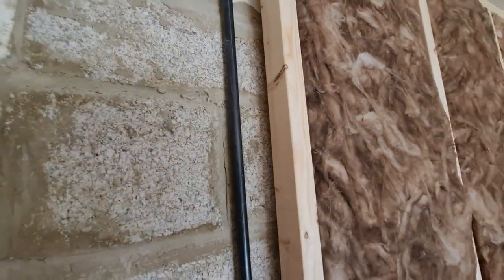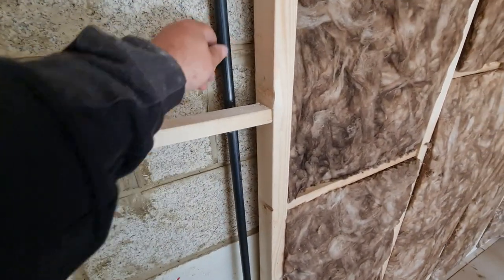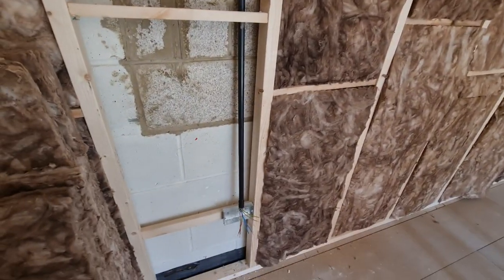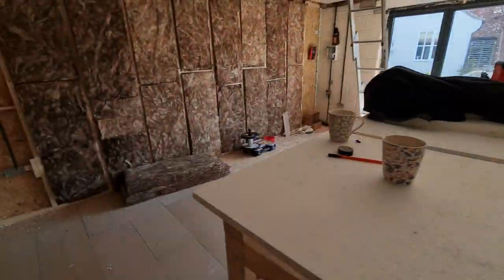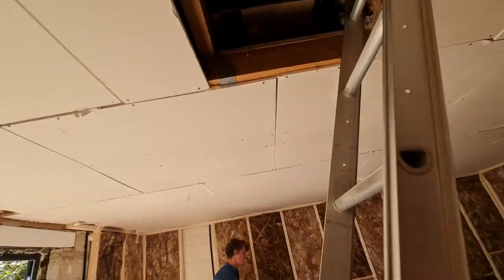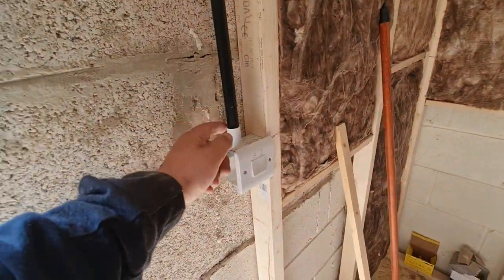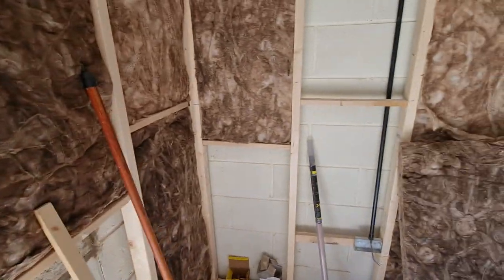Matthew is applying D-line fixings on the other sockets. These are just loose for the time being, so they drop straight down into the sockets — if there's ever an issue you can drop another cable down, because once it's boarded it's a bit of a faff. The void behind gives a bit of extra protection as well, should a mouse find its way back there. Up in the loft space there's a single light fitting with a switch — just storage up there. We've got a two-gang light switch here: one for inside, one for outside, with a little lantern light going on the outside wall.